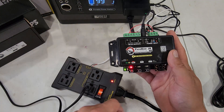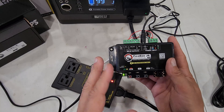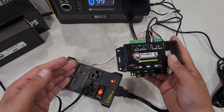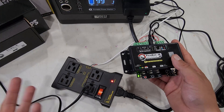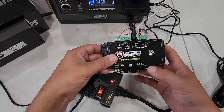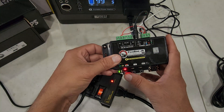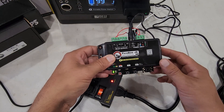So here we go: record... hold for five seconds... now we wait another five, four, three, two, one... and stop. The reason for that extra wait is so that when this activates, it goes off for five seconds, and then there's a five-second window where the trigger cannot be activated again. That works great for a haunted house — something goes off, then it resets for the next group of people. To test, tap the relay button to play, and you can see the red light flashing — it stays flashing for five seconds until the scene ends, during which the trigger won't work.